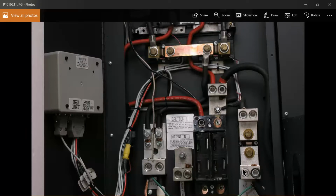Now it looks to me like that cable's not going to be long enough, so you'd probably want to get something on the order of a number 2 if you want to stick with what's in this fuse disconnect here, or a number 4. Technically a number 10 wire would suffice, but I'd say let's keep it consistent with the wiring in here if possible, and replace that with a number 2, or like I said, a minimum of maybe number 4. This then becomes your primary shunt.